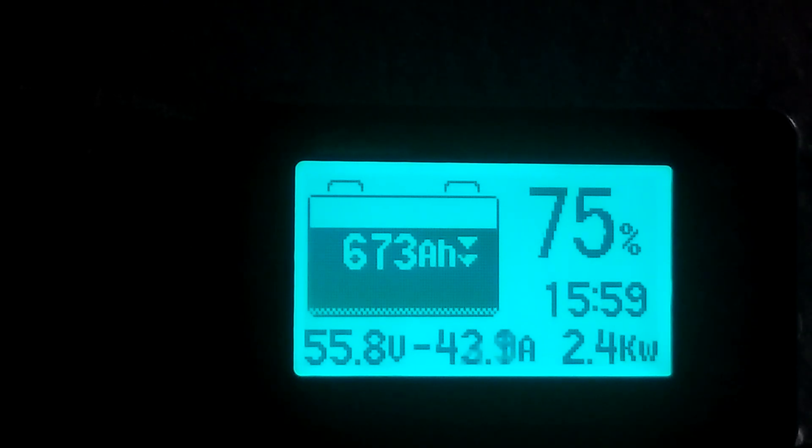It's about 1:30 in the morning. I wanted to wait until it got dark and late so we could see what it's doing. I completely shut down everything, so the only thing that's on in my sub panel is the two mini splits. I wanted to see how much power they were consuming. You can see it ramping up right now — 2,700 watts. I cranked it up about 3 degrees so I could make sure they were running.